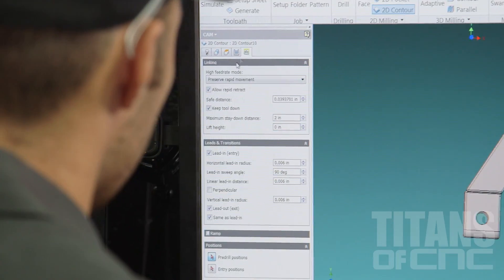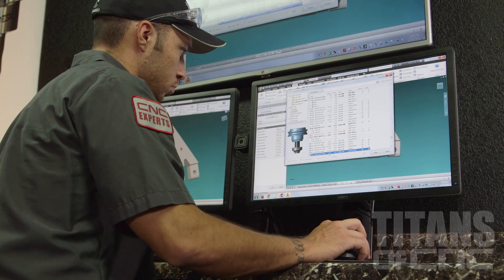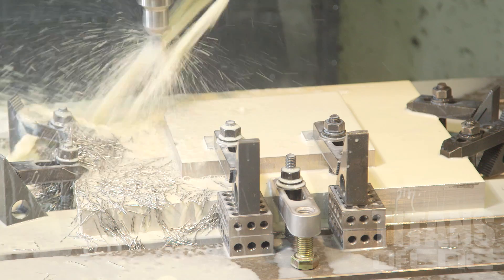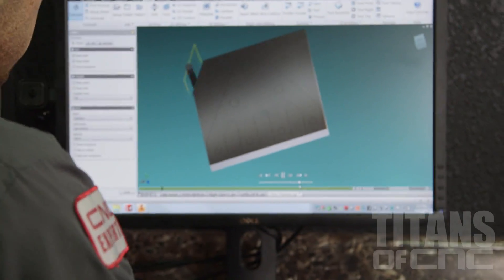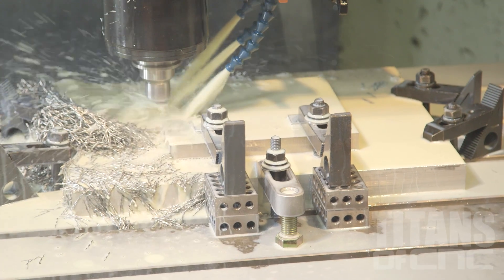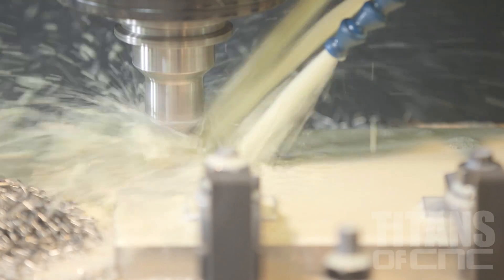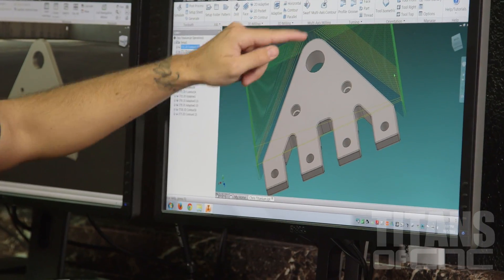Right now I'm programming the quadrant plate part for the drag racing boat on Autodesk Inventor. I'm going to start off with a half-inch Imco end mill and take it around the part to profile it. It's titanium material, so we have to take smaller cuts. We can run it at a pretty high feed rate, but we've got to be delicate with our stepovers. It's going to work its way around the part and get it to size.